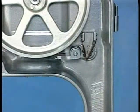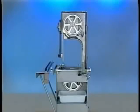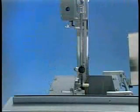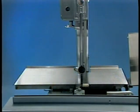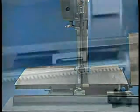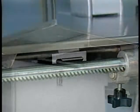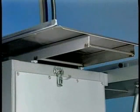Now reinstall the rear wiper assembly, the front wiper and guide assembly, the upper pulley wiper, and the base and head doors. The table is reinstalled by placing it on the base and moving it to the right. Then move the table back to the left so the support rod is hooked on the stationary clamp. Four table rests support and align the table underneath. When the table is in proper position, latch the table clamp above the left support rod.